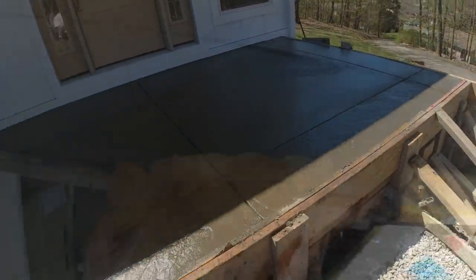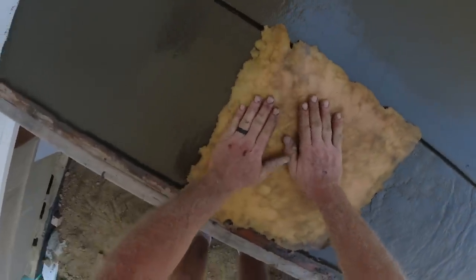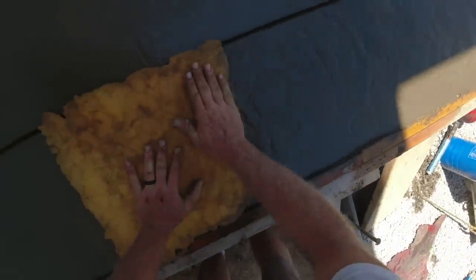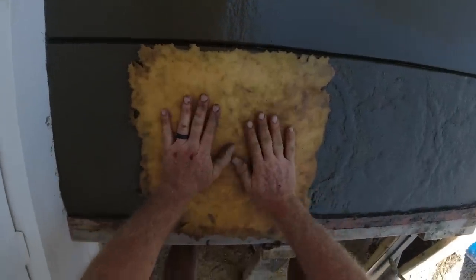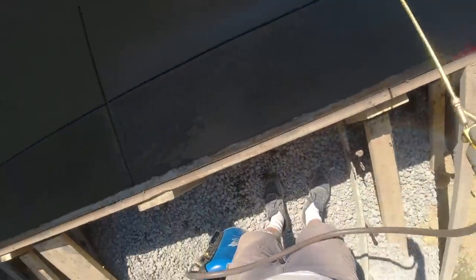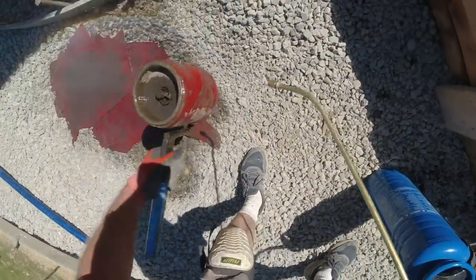I'll show you more as we're able to get on the concrete. It's been about 20 minutes — the concrete's really moving. I'm going to have to get on that soon; I wanted this border to be all done. Pick it up, give it a quarter turn, half turn, quarter turn — change that pattern up. Getting close, just trowel it all smooth. Putting a light coat on there and hitting the wheels — I'll go around the edges first.